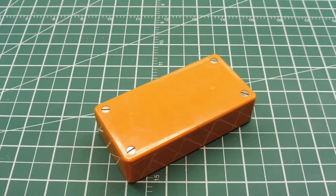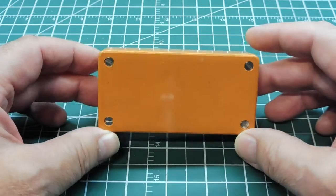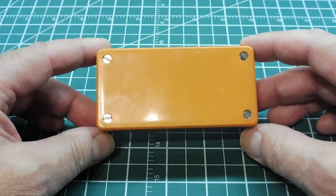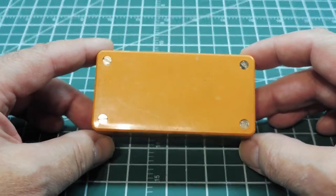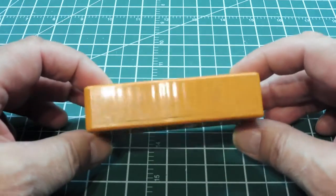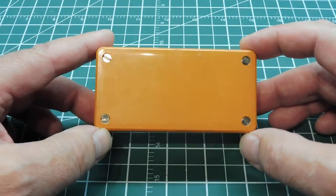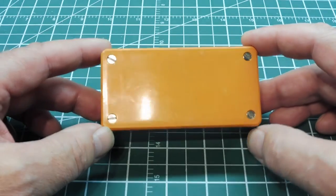I had the same problem — I just couldn't find that noise coming from my car. So I decided to build this little device here. This is a little FM radio transmitter, and it transmits on the FM broadcast band, which is 88 to 108 megahertz, receivable on your car FM radio. You plant this in certain areas of your vehicle, drive around, and listen for the noise. You can zero in on the defect, as the noise will get louder as you get closer, and find exactly where it's coming from.